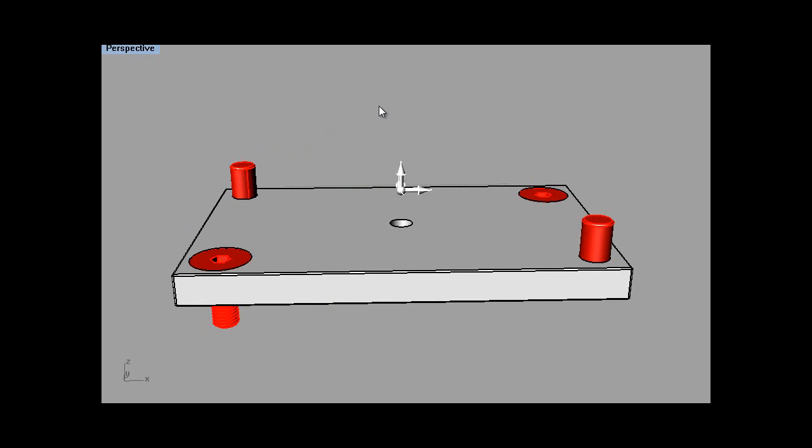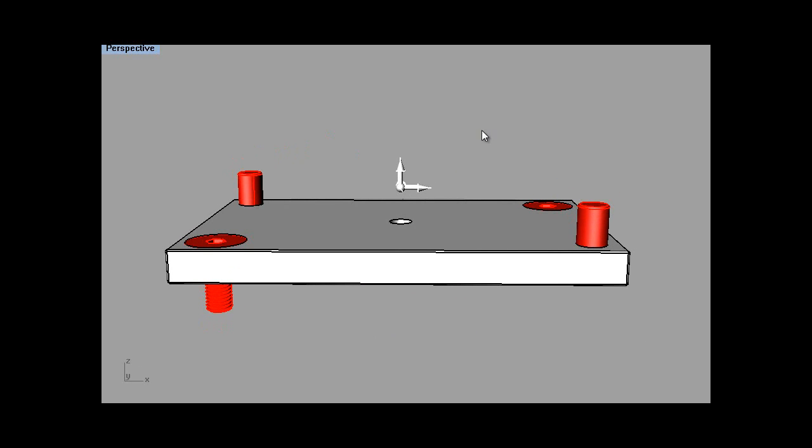Right. So then we need to set the Z axis, which is the height. So again with the metal bar in, and actually you're probably better putting the tool you're going to use in it. So jog it up out the way, put your tool in it, jog it down to an area here, again, 4 or 5 millimeter away. Slacken the spindle off slightly, and then pull the bit out so it touches the top. Don't force it, just be gentle so it touches the top.